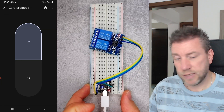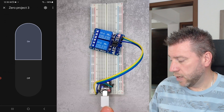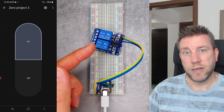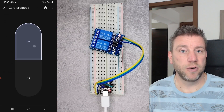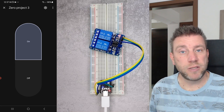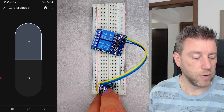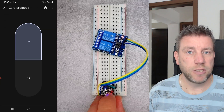In this video I'm going to create a simple single-channel device — a single-channel plug. We'll use the ESP32 to run the code and connect to the Matter-enabled network, in my case a Google Nest Hub, to drive a relay. I'm using a dual relay but only using one channel. What you get is a device you can turn on and off from your phone, create automations and scenes, connect to mains or low voltage, with a status LED and a button to control it locally. The update is a bit slow but you can see pressing the button eventually updates the status on the phone as well.